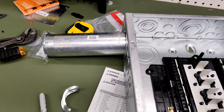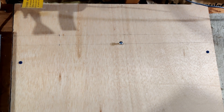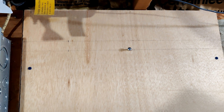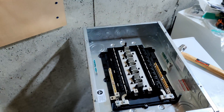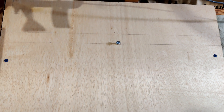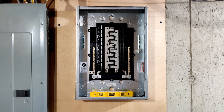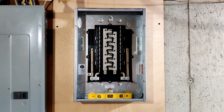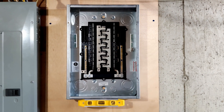That will mainly be used for running the wires for the circuits I'm going to move over into this panel. I marked six and a quarter inches from my main panel for the top of the load center, then put the load center up on the wall, marked the center pivot point, and drove a screw in so I could hang it, get it leveled, and get it mounted. I double checked my distances and I appear to be on target. Now I'm going to level it out and get it fastened to the wall permanently. She is up and level and permanently mounted.